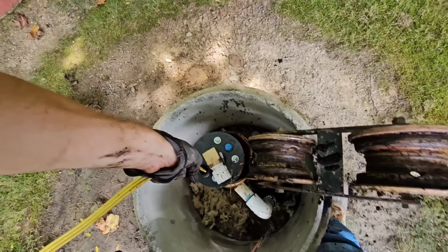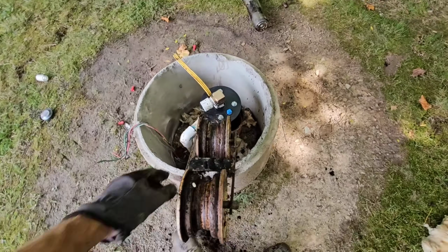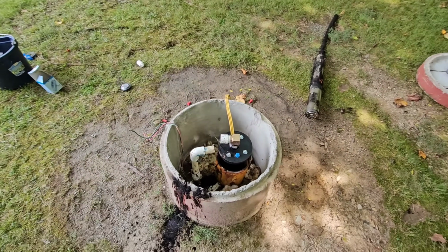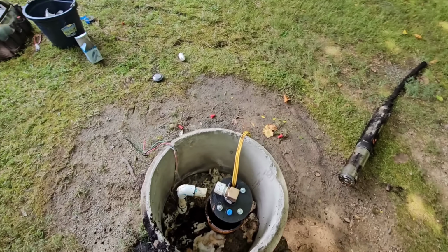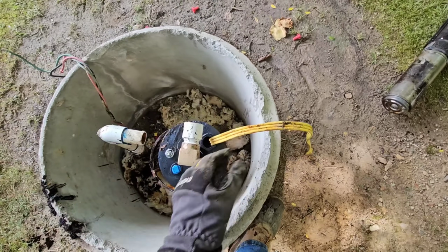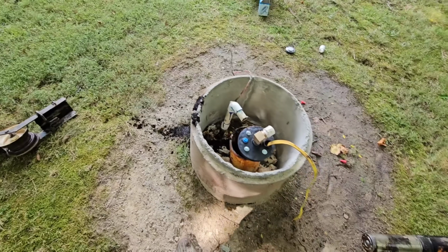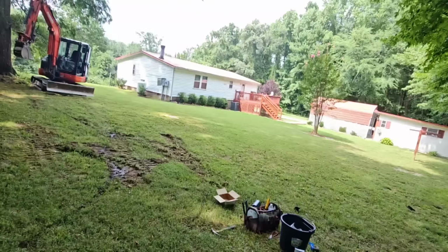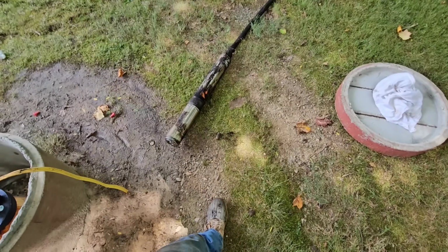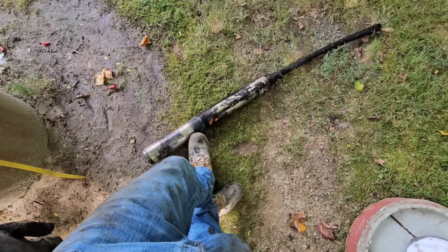Good Lord have mercy. It's probably a 50-foot static level. That's probably the issue here. Static level's so deep and the well's not deep enough. That well needs to be about 345 feet deep and that pump needs to be at 300. That would probably give them a lot better reserve to work with. But it doesn't look like we drilled this well, and I don't remember doing this. I believe that pump is like an 06 model, is what I read on it.